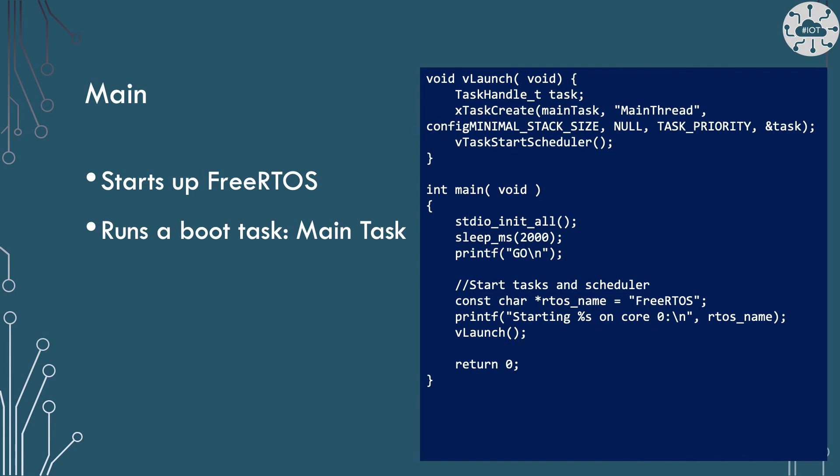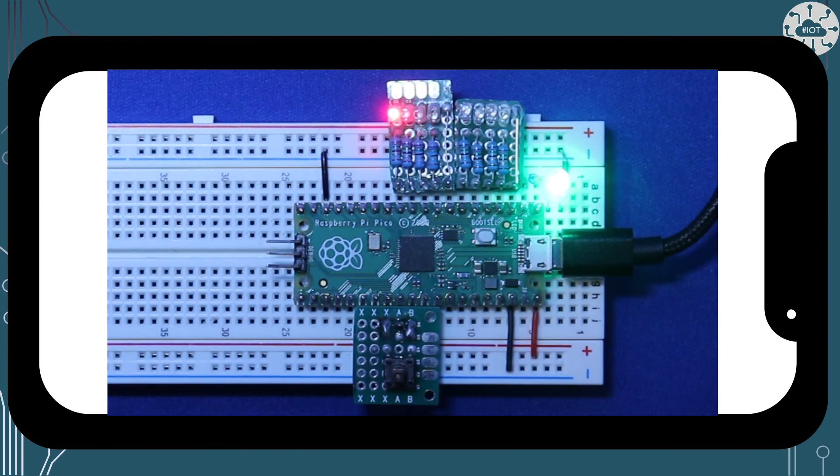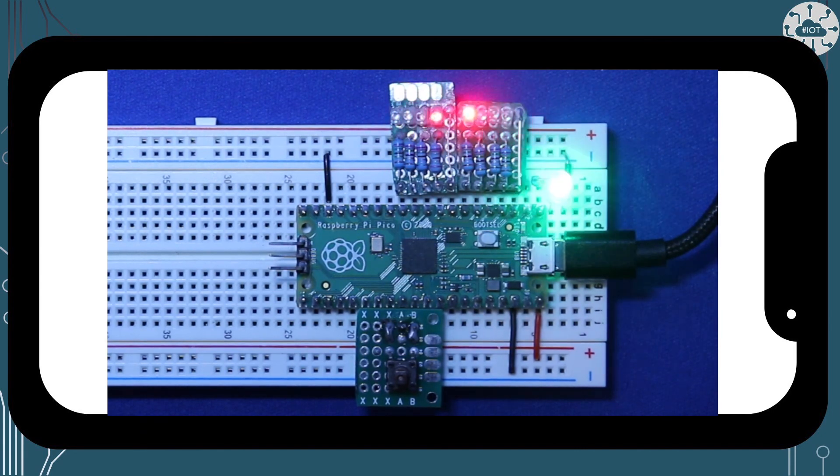Our KITT scanner agent depends on a superclass which does some magic to get FreeRTOS tasks up and running, giving us a nice interface to start, stop and manage tasks. Our main program will now start up FreeRTOS, then run a boot task called main_task. It is there that we start our KITT scanner and blink task — this code is consistent across nearly all my FreeRTOS projects. Our main task simply needs to create the two objects, blink and kit, then start them as processes and wait forever. The running code looks just the same as our polling example, but was slightly easier to write with fewer bugs in the first running version.